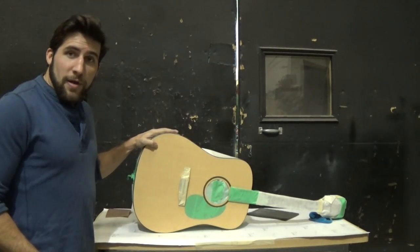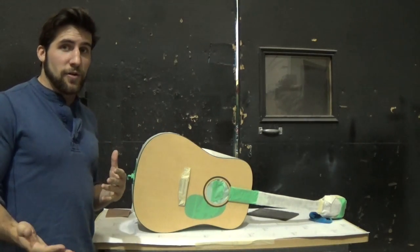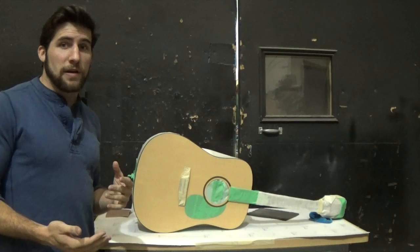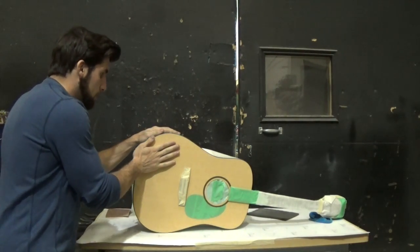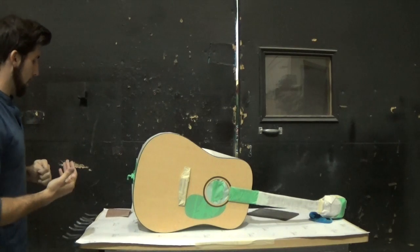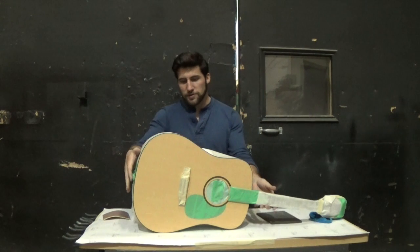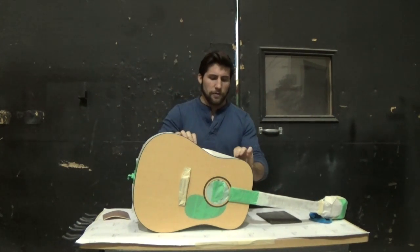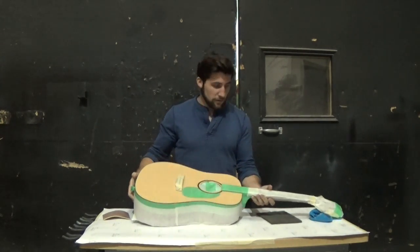Now it's time to get this prepared for the paint. As everybody should know by now if you've been watching my videos, we need to sand it — we need to scuff it up a little bit. It's got a very thin finish, and most likely that finish is shellac, which is nice because everything is compatible with shellac. But it will be cured regardless, so it shouldn't really matter at this point what that original finish was.